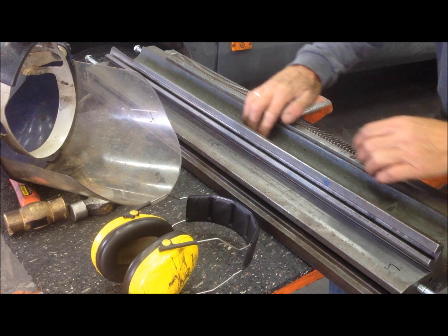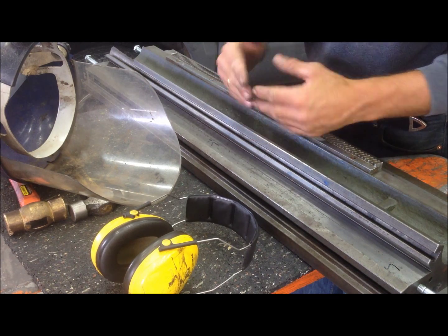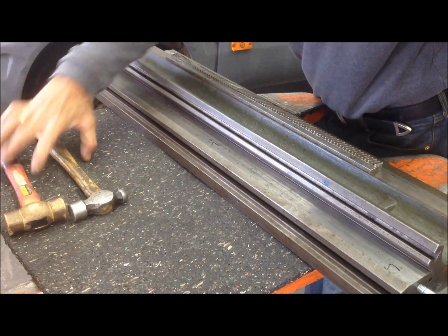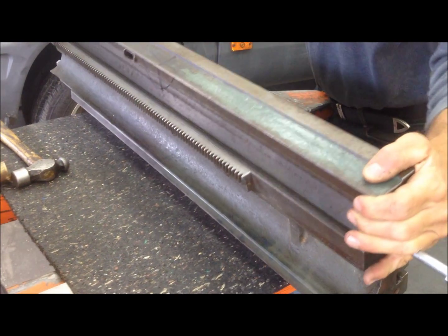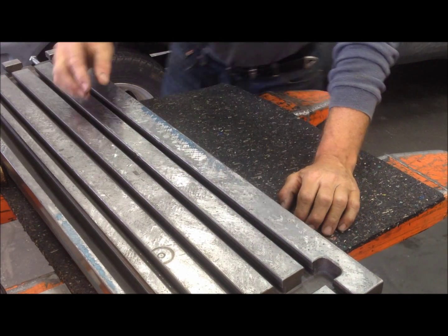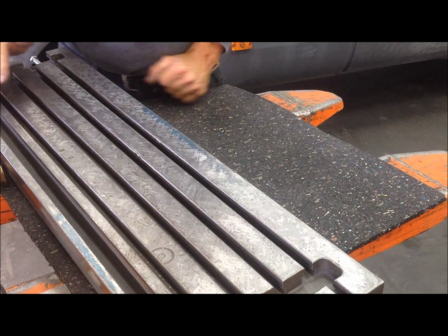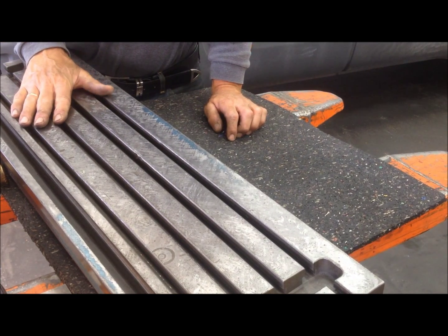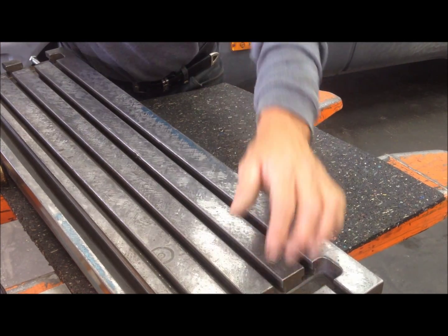This is actually a method for the tables. This is a banana-shaped table because of the wear and use of the T-slots. Because of the clamping within the use of the T-slots, the table has been bent. So the peening with the hammer is a means to relieve the stresses again before you start scraping, so you have a lesser job to get it flat again.